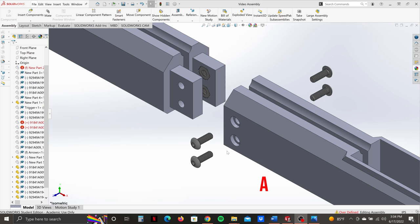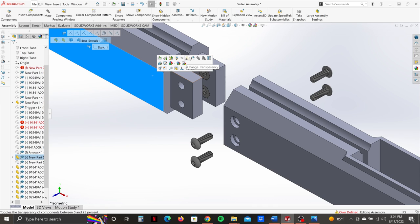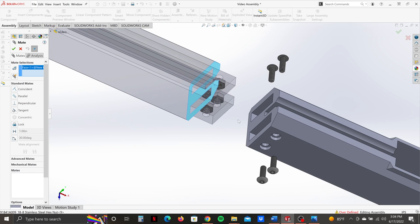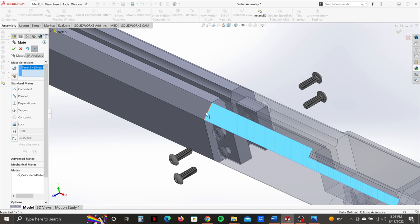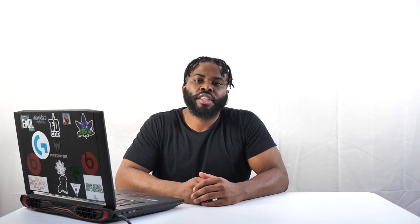The components that make up the flight groove are assembled using a similar method but with a difference. Component A has two slots with two quarter-inch counterbore holes evenly spaced apart — this is the female end. The counterbore holes are on both sides but don't go all the way through. Component B has two inserts with quarter-inch counterbore hex holes on the inside walls for screw nuts. With a suitable tolerance, these components come together fastened using four half-inch Everbuilt machine screws and four corresponding nuts. This method is also used to assemble the riser to the end of the flight groove.